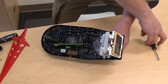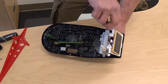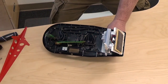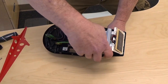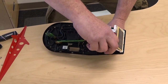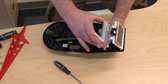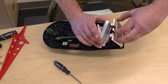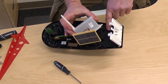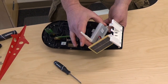Using the smaller screwdriver, take off the two screws on either side of the transmitter box. Beneath the transmitter box you have the cover for the wind position sensor — you don't need to lift that off, but it may want to. Just hold it down with your thumb.